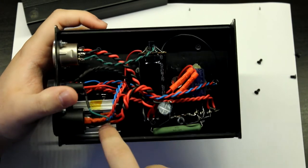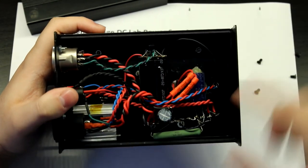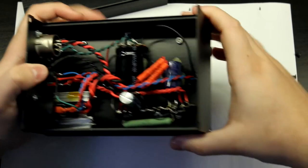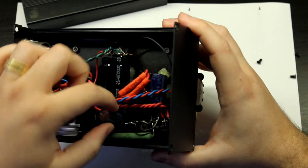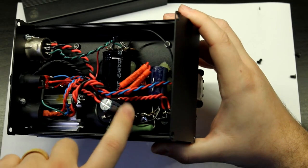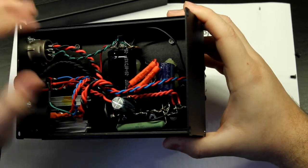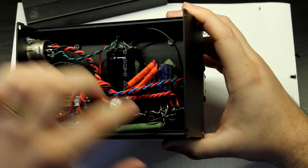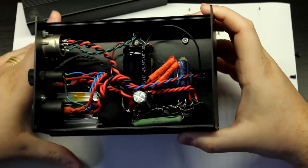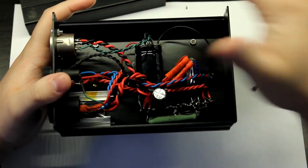So this is probably a 6.3 volt output. Let me just see one thing in here. Where is it? Oh yeah, here you go, the center terminal. It's passing through two rectifying diodes, just to elevate the output voltage. Since this is going to be like 0.6 and 0.6, the output's probably around 6.3, 6.2 volts. And then some filtering, and that goes to the output.